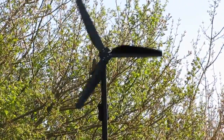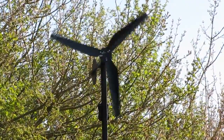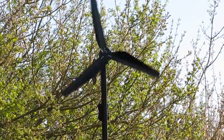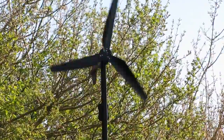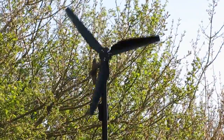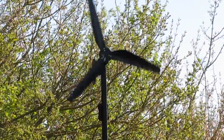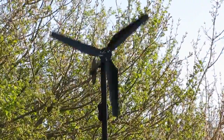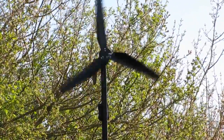This is another little wind turbine I made out of scrap wood and just a NEMA 17 stepper motor. It puts out about 20 volts and about 0.6 amps. Without a regulator you can just hook it onto a battery and it will keep it charged to about 13 volts.